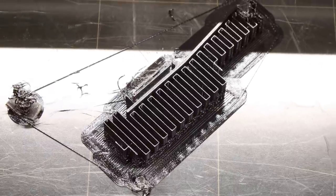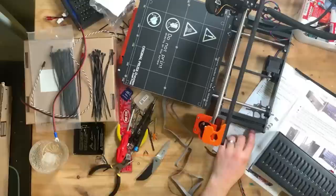All in all, would you say resin is harder to print than FDM? I actually think resin is significantly easier than FDM. Resin machines are so simple — it's one axis that moves repeatedly. There are so few things that can go wrong. Almost always either leveling is incorrect or they're printing too cold. FDM has so many variables: your filament can be dodgy, it could be wet, and you have a billion different screws and belts and axes that could all be wrong. With resin there's just so few things to check.